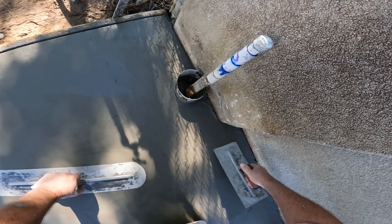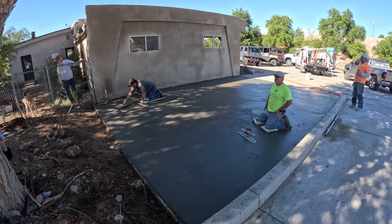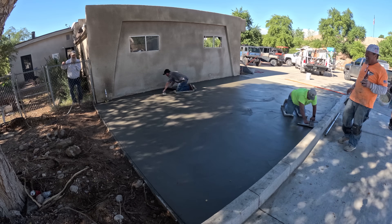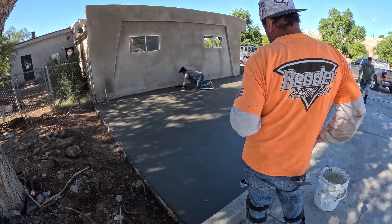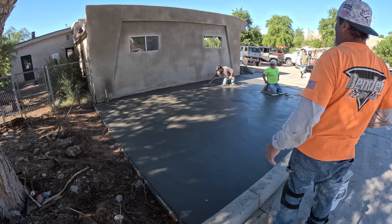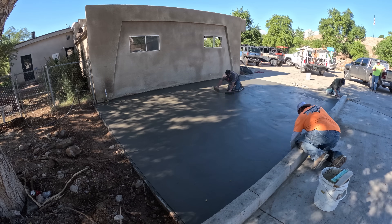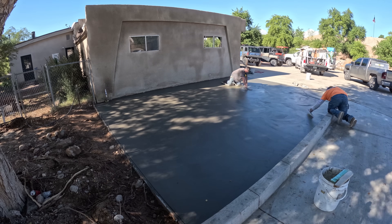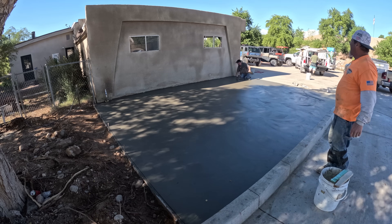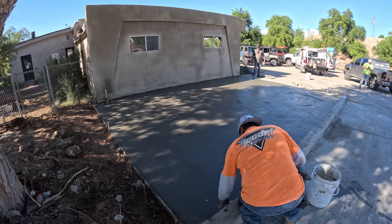I initially thought let's just whip it and forget it. Then Doug was like, let's hit it once after we whipped it really nice and tight — let's hit it once off the boards and see what we can get. This is a flat slab so sliders are working great on it. But if you've run into it — on a hillside with sliders, they don't work very well. They slide down the hill before you can finish the concrete, and you're at the bottom when you should still be at the top.